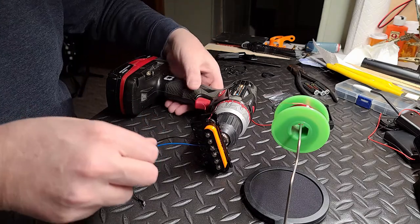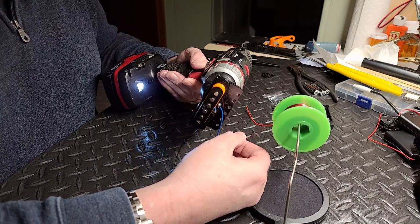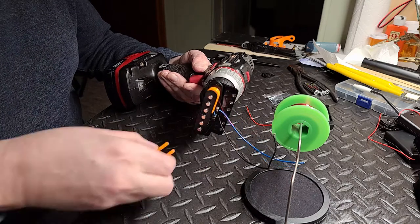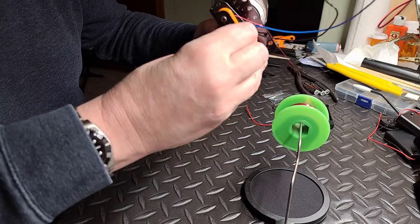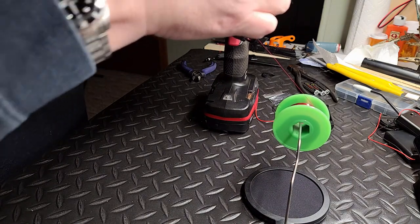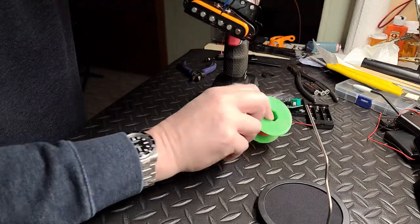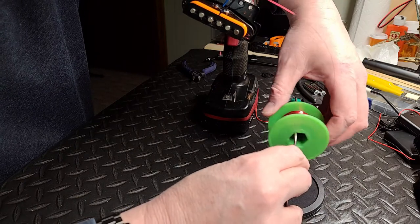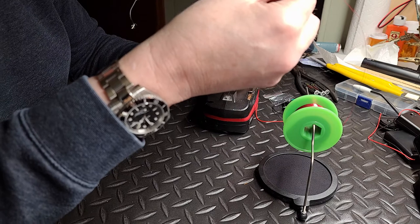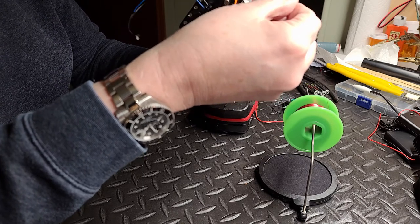Here you can see the pickup I used that has a bar magnet across the bottom with individual pins — they're probably not magnetized. I made a little spacer on my 3D printer to give it about three millimeters of space. I wanted to do about 120 winds to try and get this as close to 8 ohms as I possibly could. That is my little improvised winding station — I used the tremolo plate from an old tremolo and the magnet stuck to that, and I stuck that on my drill. In the long run it worked out. I got it wound up at 120 winds and I had 9 ohms — I was not going to fuss about it, it was close enough. You want 8 ohms as your target because you're effectively making a speaker out of this, just without the diaphragm to make any noise. You just want it to vibrate the strings whenever there's signal going through it.